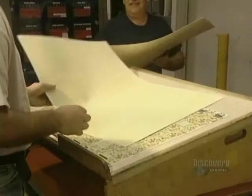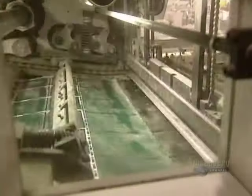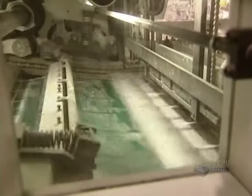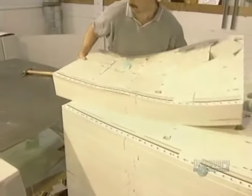The precision of the embossing is then verified. Next comes the cutting of the sheets, going on at 8,000 an hour. The cutting unit strips and removes the unnecessary pieces, and the carton scraps are sucked up for eventual recycling.